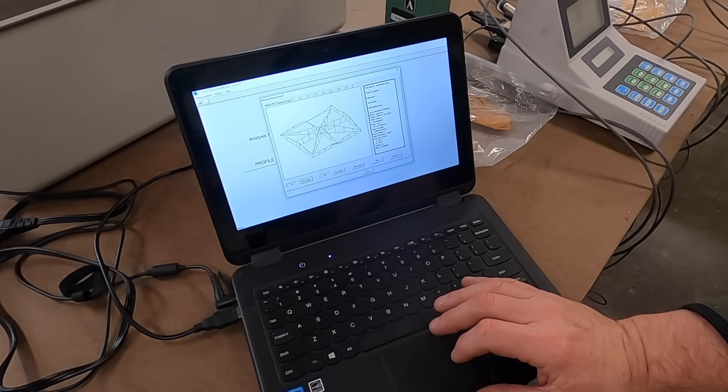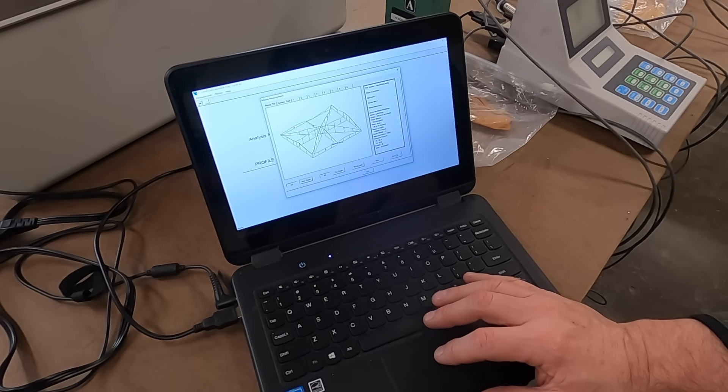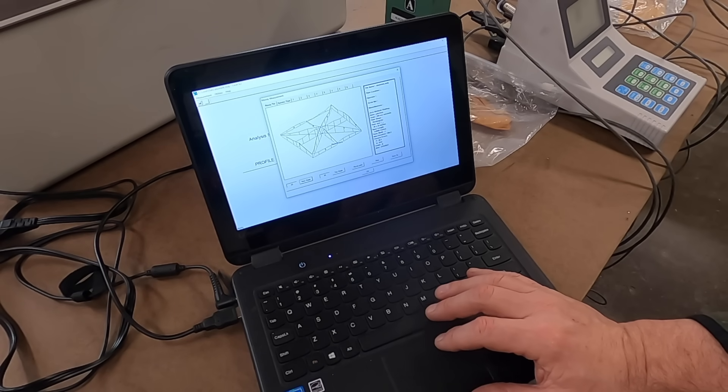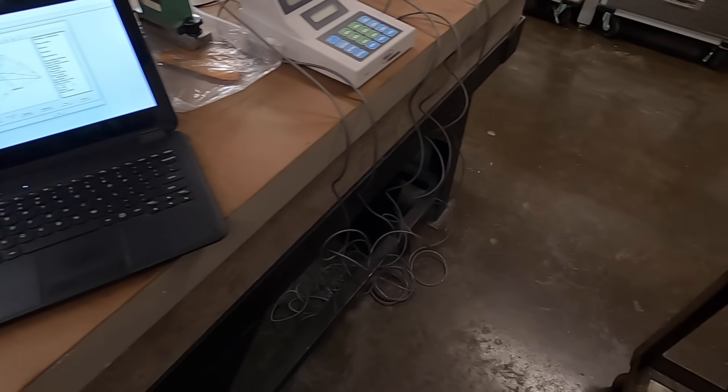We just took the last reading. Basically this is a B plate and it's not in that bad a condition, Adam. We did get a really good reading — our intercepts are all under 30 millionths. So the overall elevation difference on this plate is two ten-thousandths — two tenths. That's better than I expected. We'll go look up what a two-foot by three-foot plate grades at and see what it'll take to get this better than an A.